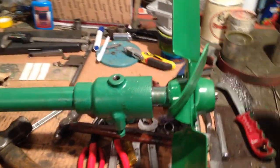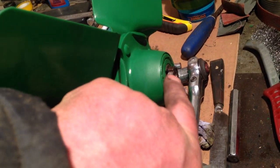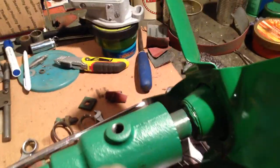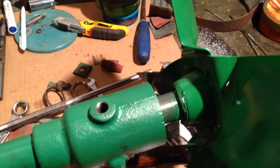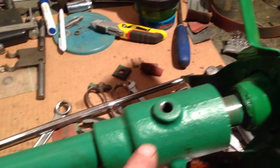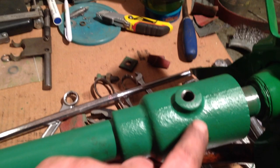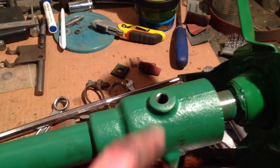So yeah, there we go. So really just the collets that hold in here, hold the thing on. As I say, the pulley goes in here. Remember it's of a split rim type pulley, so it's two halves, it bolts together. And then you put your grease nipple in there for greasing that bearing. As I say, just pack it initially, but don't overdo it. And then every so often on the service, just give it a couple of squirts of grease.